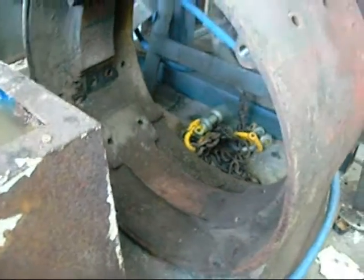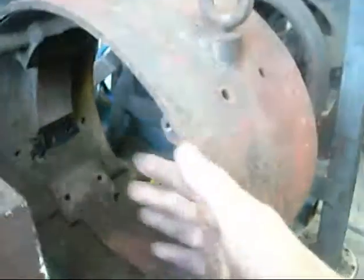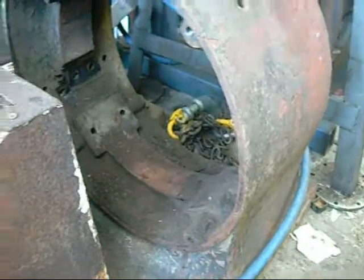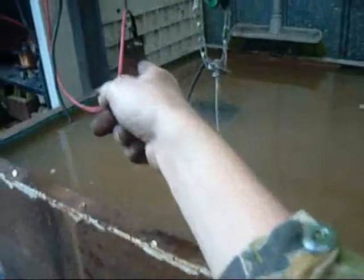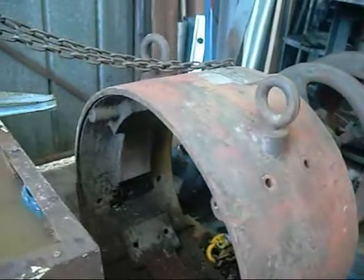When it comes to doing the inside of something like this, the best bet is to set up an anode inside it. This is going to be laying on its face, so what I'm going to do is take a 13-inch car wheel or something fairly small like that, and just make a post which will sit in the bottom on the base anode plate. I'll also have a mechanical connection going up to that other lug at the top of the anode strap, so that way there is a sacrificial anode sitting inside here in place of a rotor, and that will clean all the insides while the outside gets taken care of too.